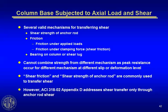That vertical raising of the concrete from cracking creates a clamping force on the anchor rod. And so what happens really is that when you have big shear on an anchor rod assembly, it's not shear in the anchor that's being developed. It's really tension in the anchor. So the concept of shear friction is you're taking a shear force and translating it into a tensile force by a shear friction mechanism. That's what the shear friction concept is all about in Chapter 11 of ACI.